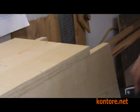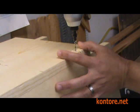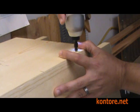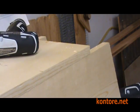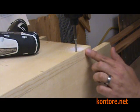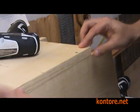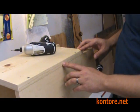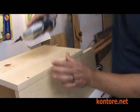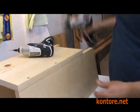Next, do the screw toward the top — follow the same procedure: pre-drill with the countersink and fasten with the one-and-five-eighths-inch screw. When you drill these holes, they should be about a quarter to three-eighths of an inch away from the edge. As you're fastening, make sure the wood is flush between the edge of the front and the side. Now that these two screws are in place, drill and fasten the center hole. That's one side complete.